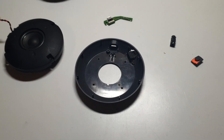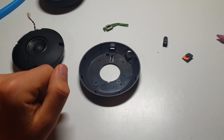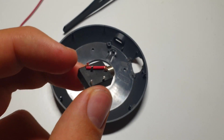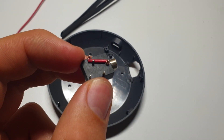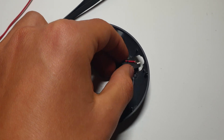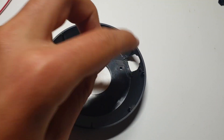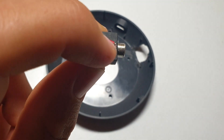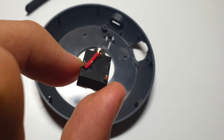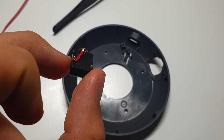I'll also leave wiring information down in the description below so you can see exactly how it's wired, because some tutorials aren't very clear on that. So I'm going to glue this in and then I'll be right back. Just before I go on my hot glue adventure — I added this little connection here from this pin to the front, because when I'm hot gluing this in, it's going to make it extremely hard to get to this front pin as it's going to be touching the outer rim of the shell. I also made sure to get isolation between these two pins here just to avoid the solder from touching them.